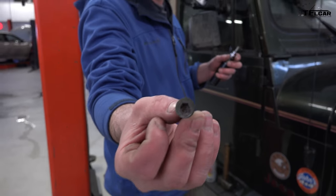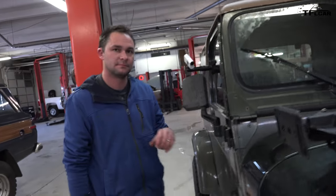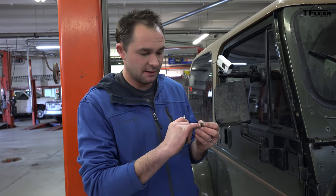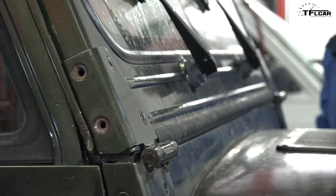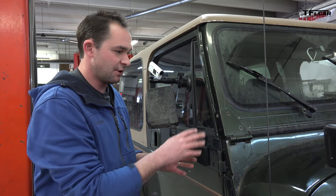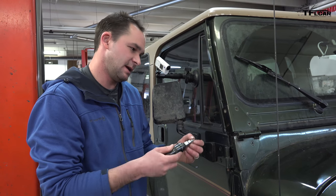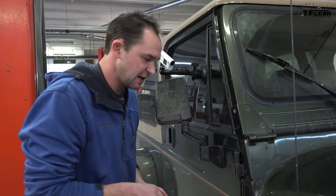I rounded out that cut, but we got it. The Torx head bolt does offer more grip surface area because of each finger of this star-shaped device getting in there, so it really does handle higher torque load than a hex head or an Allen head bolt. Someone's already been in and worked on these bolts and tried to extract them without success, so we're starting with something that's a little bit misfigured. Any bolt head can strip whether it's a Phillips, hex, or Allen — just got to be careful and use the right tools.